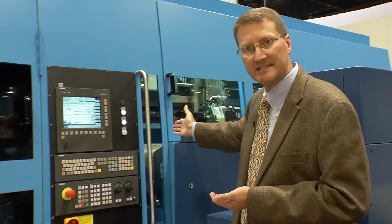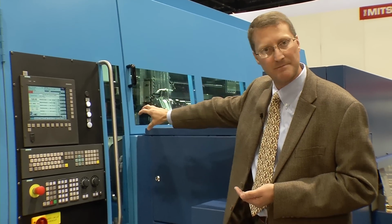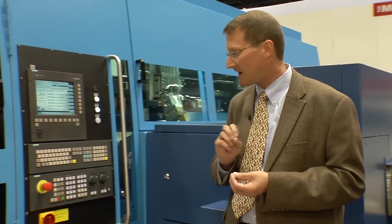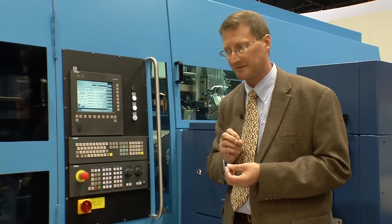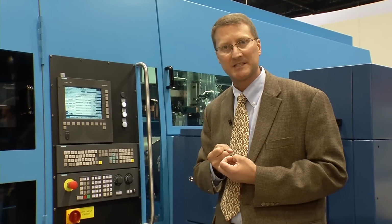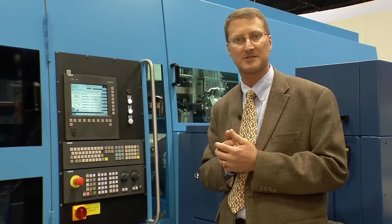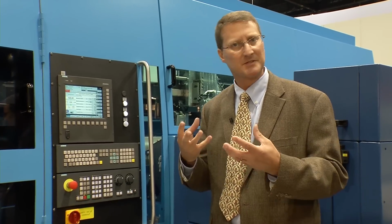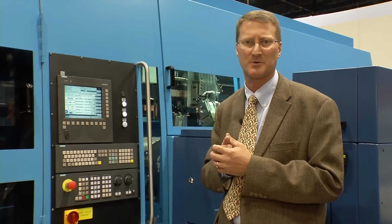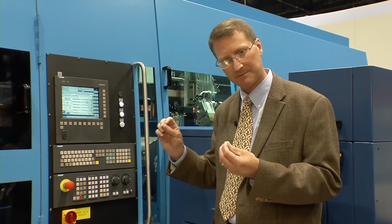After cutting in the ACS CFM Curve, we have a robotic arm that unloads the part into our chamfering. The chamfering station on the ACS CFM Curve, again unique to the industry. The part is held in clamps, monitored for pressure, monitored for clamping position, so we're looking for any chips or debris or anything that could be in there that could again cause an out of square condition when we're machining. We'll detect that, we'll stop the process if everything is not perfect.